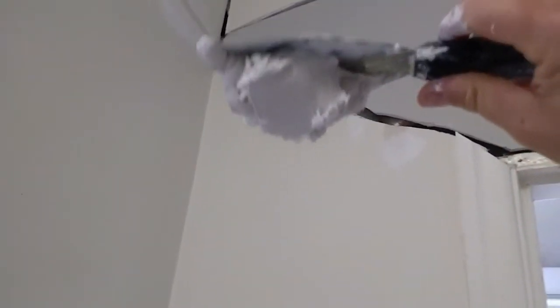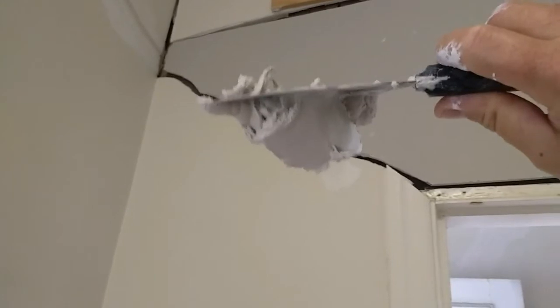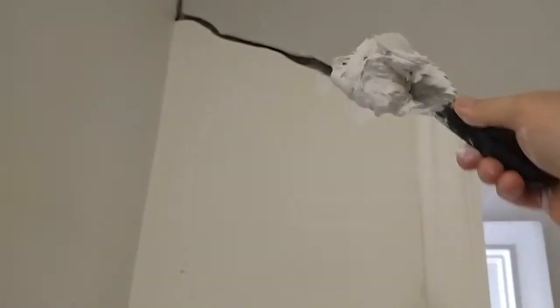You can put it on very thick like this, and even if you made it a bit runnier it would still stick to itself. It sticks to the plasterboard pretty much as soon as you put it on, so it won't be dropping down out of those gaps. Just whack it in and that will not be coming out in a hurry.